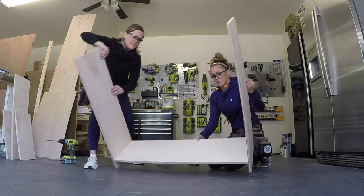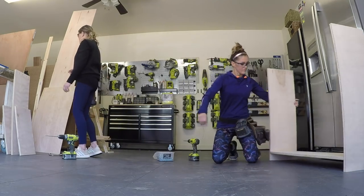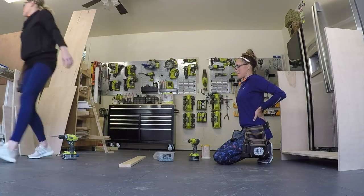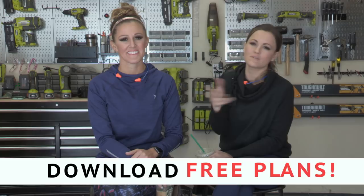We have part of our coffee cabinet built, so we'll push this off to the side and get our one-by-four boards. Now that the frame of the coffee cabinet is done, it's time to build the face frame to go on the front of it. The bottom of the face frame is one-by-four; our sides and tops are one-by-three. We're attaching everything using one-and-a-quarter inch pocket hole screws. Don't forget to download the plans — it has all the measurements for you.